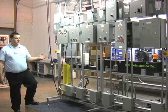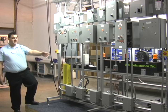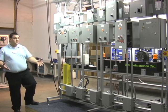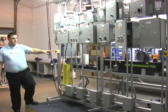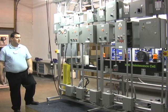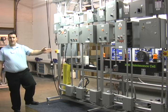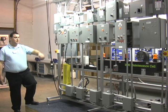When the next batch goes through, it's continuous processing. The system runs the paint cycle and then the bake cycle. You can actually see through a small port on the side of the tunnel — a simulated set of lights come on to indicate that paint is on and bake is on. Then the third step is the cool cycle, where you'll see paint, bake, and the cooling fan all come on at the same time. The PLC is running all the outputs — both the lighting and the actual motor.